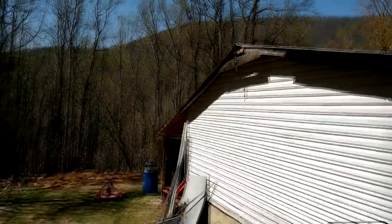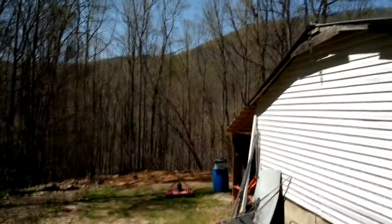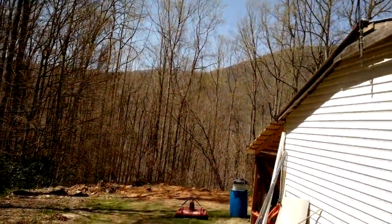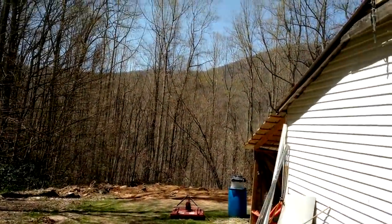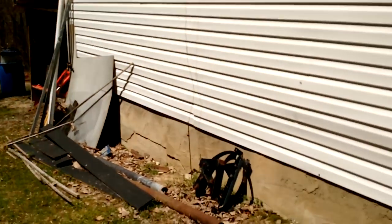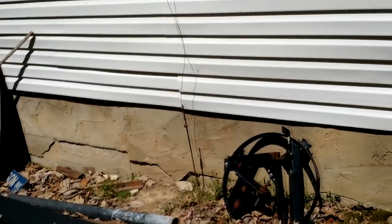That's it — it's a short video, a review of the old Antron A99. Here are a couple pictures of what they look like new. They're still available, and you can get a ground plane kit for it. I'd urge you, if you're going to buy an Antron, to probably skip the ground plane kit but invest in high quality wiring and a really good grounding rod and ground wire kit. I hope you enjoyed it, and I'll see you next time. Take care, bye.